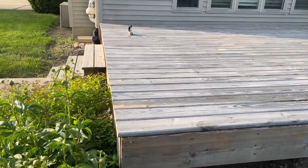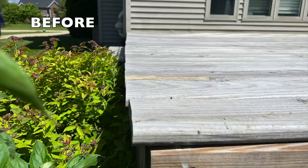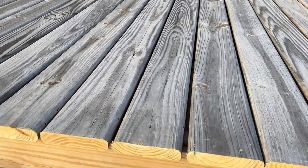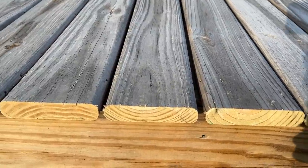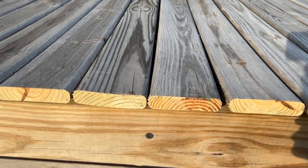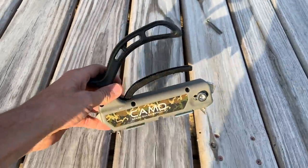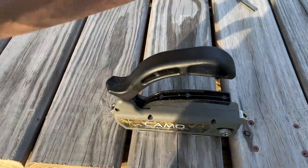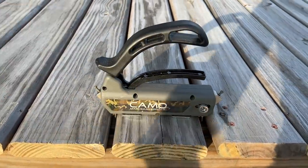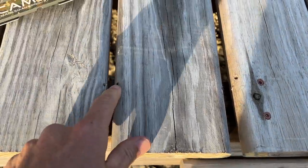So here's the deck. One thing I did today is I cut the end boards again because they were shrinking up quite a bit over the first two years. You can see the gaps that have formed — they vary from about three-eighths of an inch to a quarter of an inch, and all these boards were set with zero gaps when I first installed them. I installed these using the CAMO fastening system: you put it right on your joist, drop screws into the two holes, sink them with an impact driver, and that conceals your fasteners. You can see the little fastener holes — it works really well.